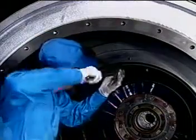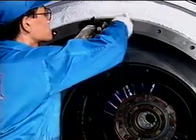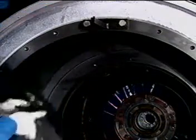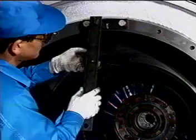Assemble the guide bar and extension bar. Screw them in the upper tapped hole. Install the extractor. Bolt the fulcrum to the air outlet casing and suspend the notched blade from the fulcrum. Then put the guide bar in a notch.